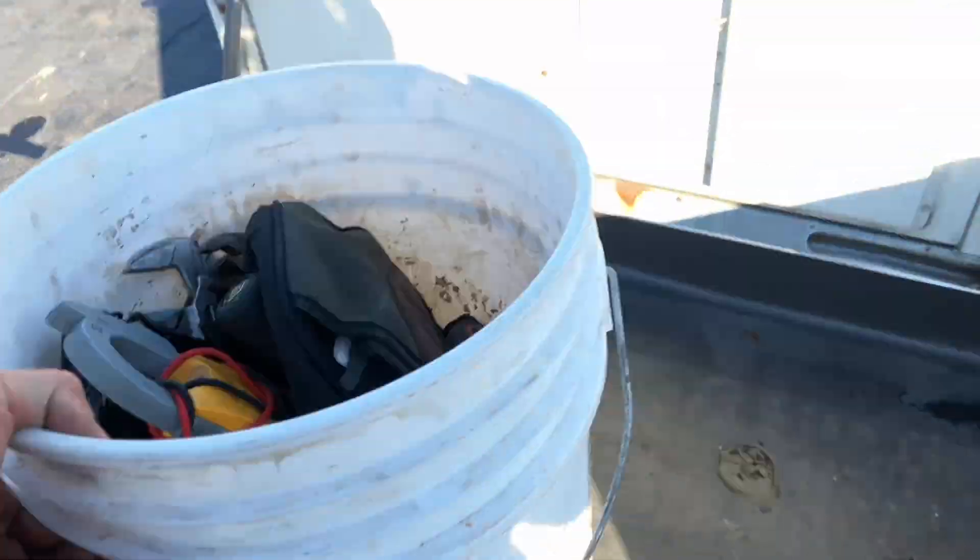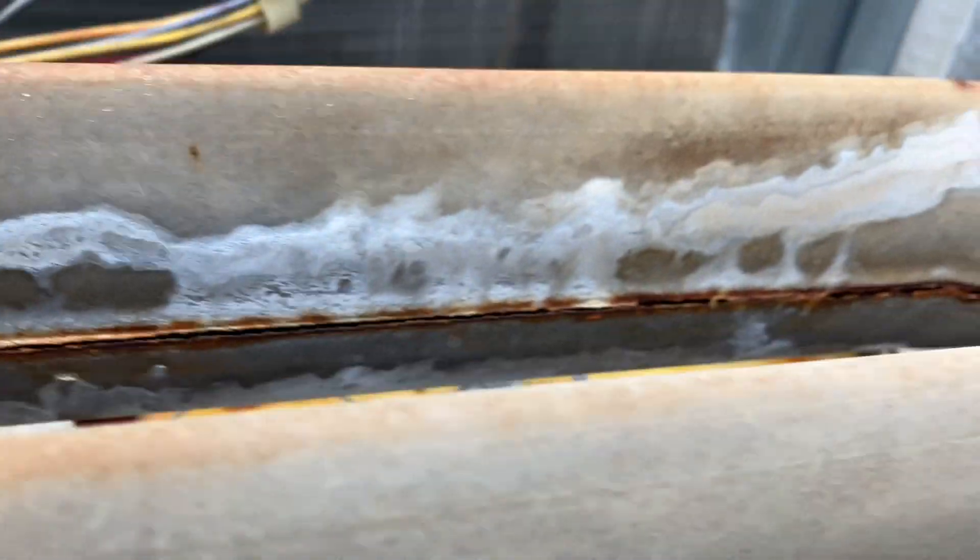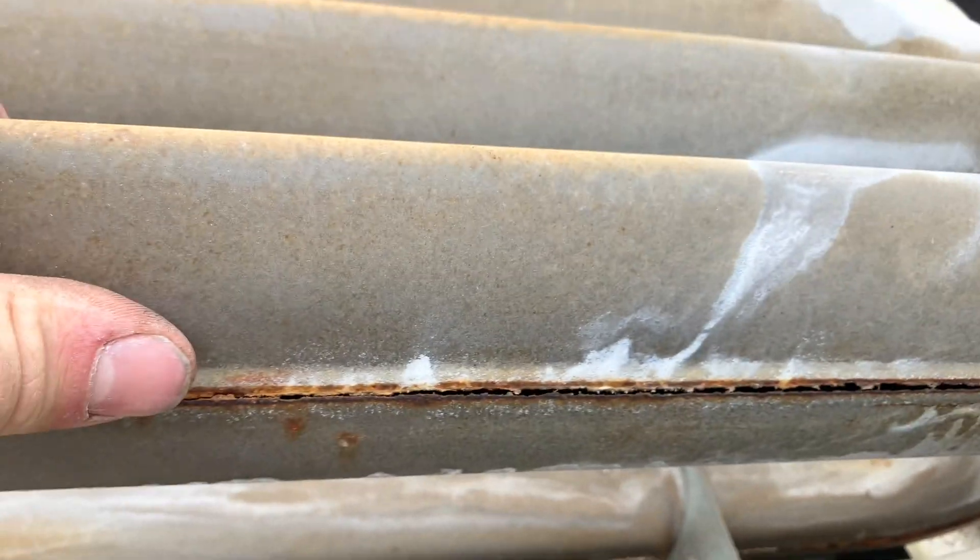Good morning. Do you remember this unit? It's still iced up. From the previous video, we were deciding between swapping out just the heat exchanger or replacing the whole unit. They decided to replace the heat exchanger, so Saturday me and another guy came and swapped it out — took about three hours. Due to time constraints, I didn't film it. When we got it installed and tried to turn it on, there were a couple problems with the inducer — it wasn't firing right away. So I couldn't finish it on Saturday. We got a new inducer motor and we're here to install it and troubleshoot what's going on.